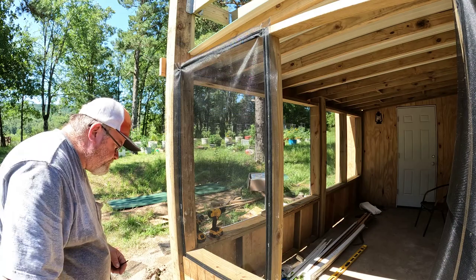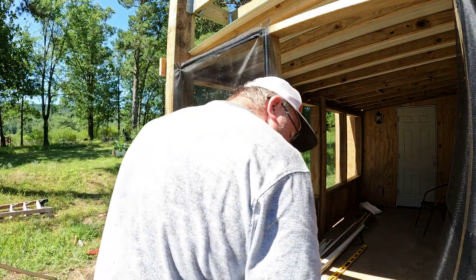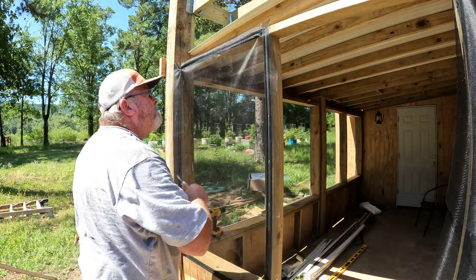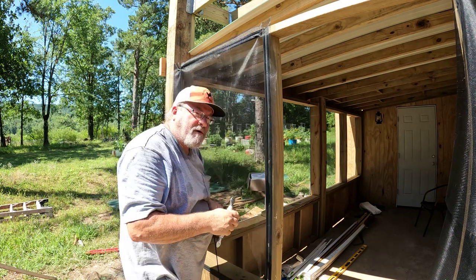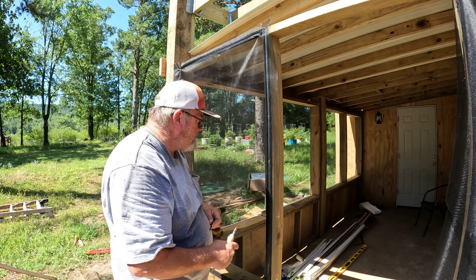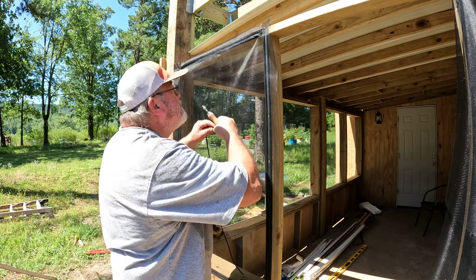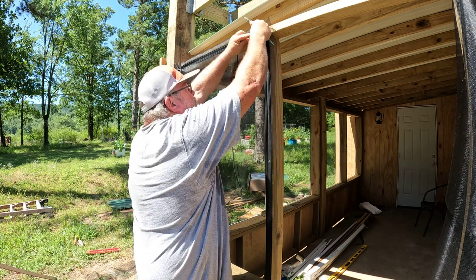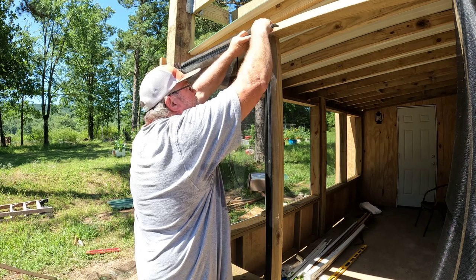All right, got this one cut. Where's my spline tool? There it is. I got a tip from a subscriber: if I do the top and then the bottom and then the sides last, the screen will get tighter. And he was right. The other three I did are much tighter, and then I redid that first one that way. So thank you for that. See, I use people's advice.